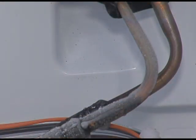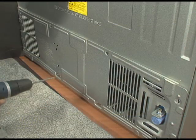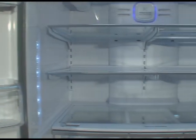Finally, check the status of evaporator frost and heating of the condenser. Connect the cover back to the machine compartment. Apply power to the product and check the refrigerator starting and cooling capacity.